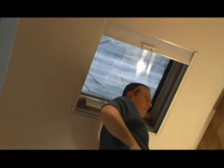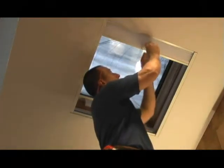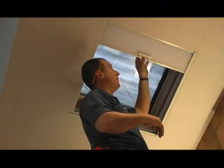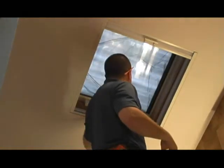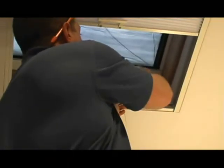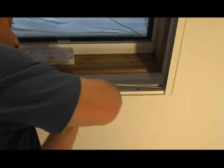Once the bottom rail is secure, you'll be able to test the functionality of the shade by grabbing the handle and moving the shade up and down. There are two very important adjustments: one is the tension adjustment of the shade, and the other is the equalizer — whether or not your shade is going down straight. The tension adjuster is the spring you see right here in the bottom rail. To increase the tension, expand the spring and re-tie the knot in place. To reduce tension, remove the knot and retract the spring until the tension is acceptable.